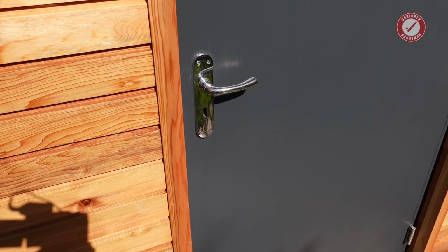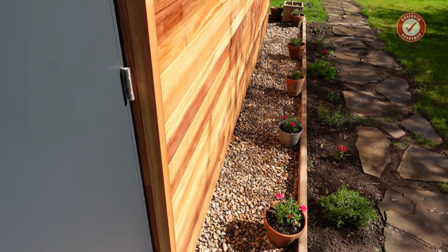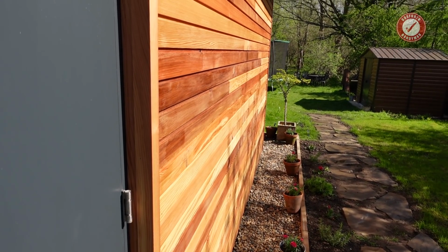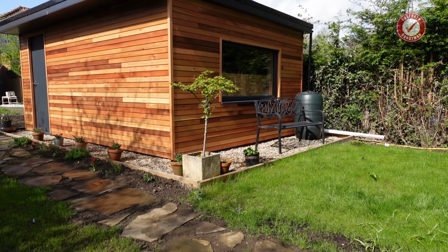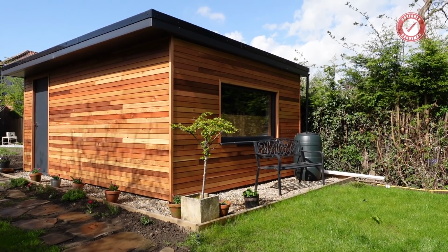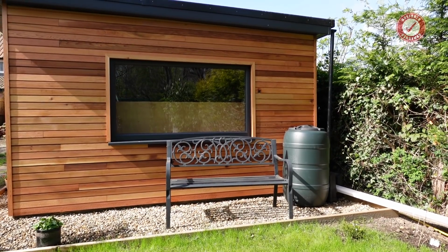The biggest problem is going to be the soffits, but watch this space and we'll see how well the ceiling performs. By the way, the ceiling will be a sandwich of 15mm sound block plasterboard and Tech Sound acoustic membrane, all suspended from the Genie clips I mentioned earlier. There will be 100mm of acoustic insulation over the top of that, so if everything goes according to plan, it should work pretty well, fingers crossed.